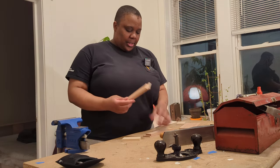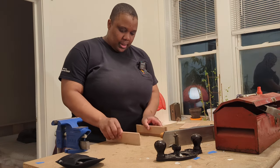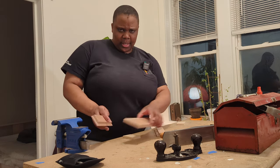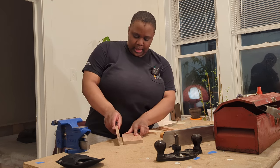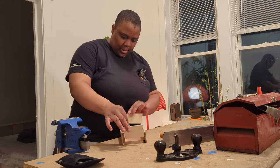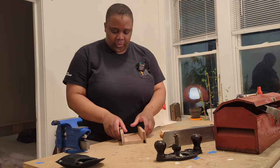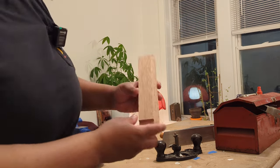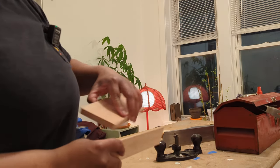So I have these pieces here which will be the sides of my box. I have my bottom and then my side pieces, and then I have some face pieces made out of a different wood — I think the contrast will be cute. I used a table saw to cut these grooves around so that the bottom can set into it.